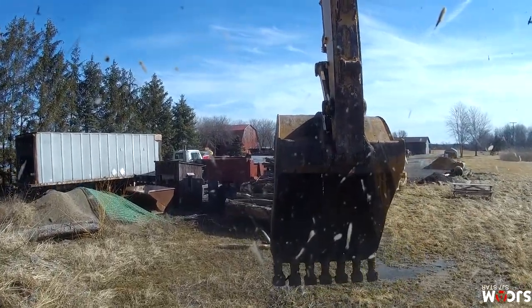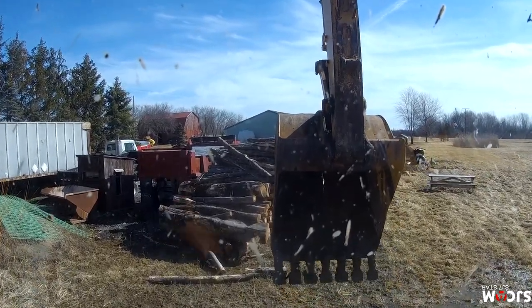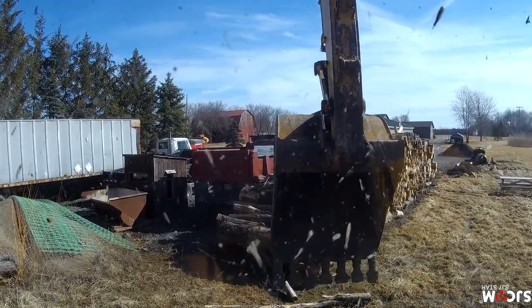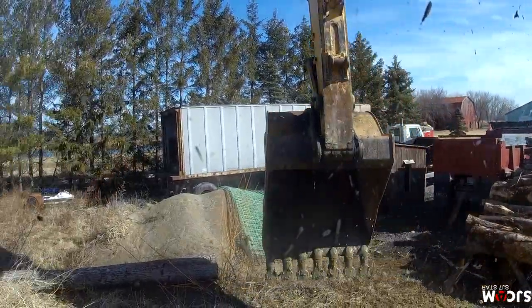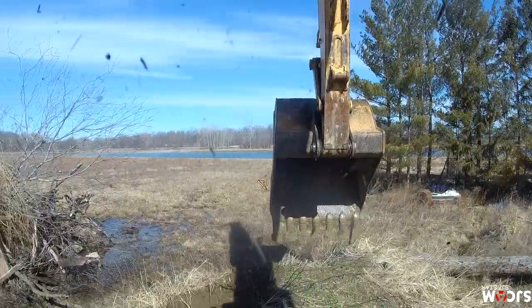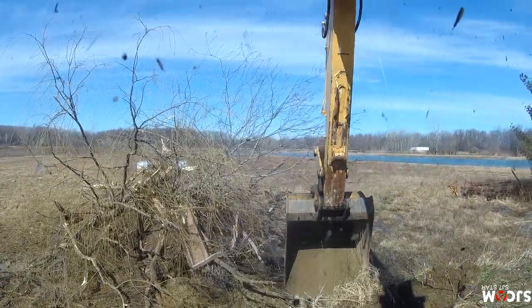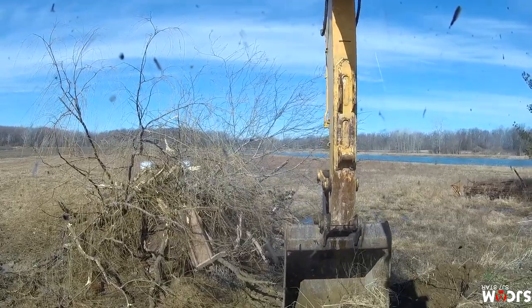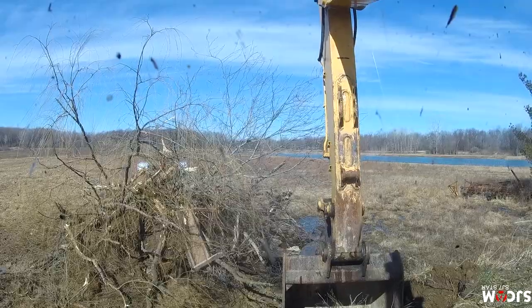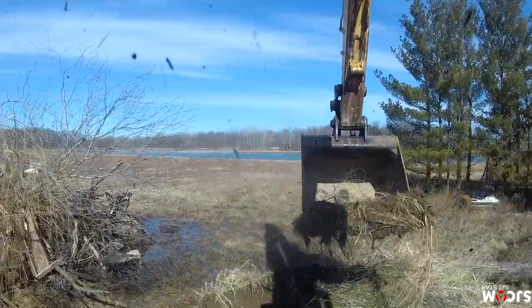Like I said, I pushed compressed air through the return line before, and I could hear it bubbling in the tank, so I thought it was good. Well, it had flow, but it didn't have the appropriate flow, so I took the line off at the other end, and I blew backwards, and found all the clutch material that was missing from the clutches.